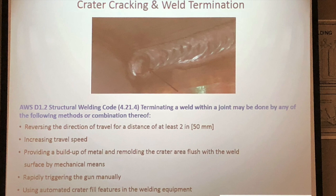Crater fill and weld termination — what do you do when you come to the end of a weld? You need to make sure you have no crater crack originating. Miller suggests a few solutions: reversing travel direction and backing up — though on MIG you may have gas coverage issues depending on how you hold the gun. If you have the option to lower your settings using a crater fill function or remote control, that helps. On MIG, reducing wire speed and voltage proportionally at the same time, or on stick lowering amperage, lets you pile up cooler material in the crater while it's still liquid and fill it that way.